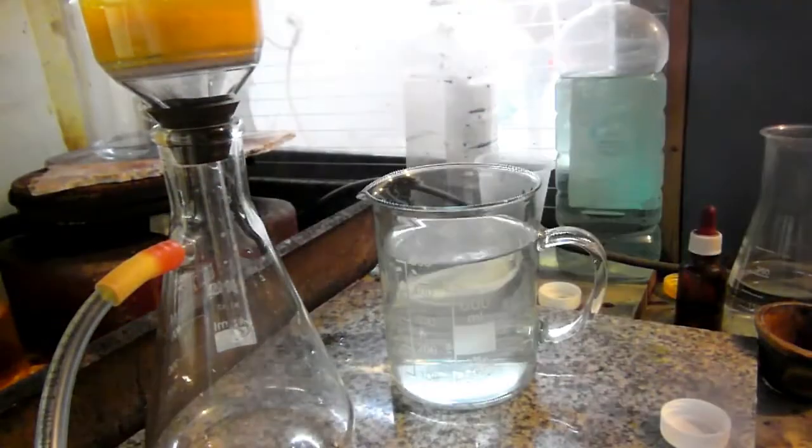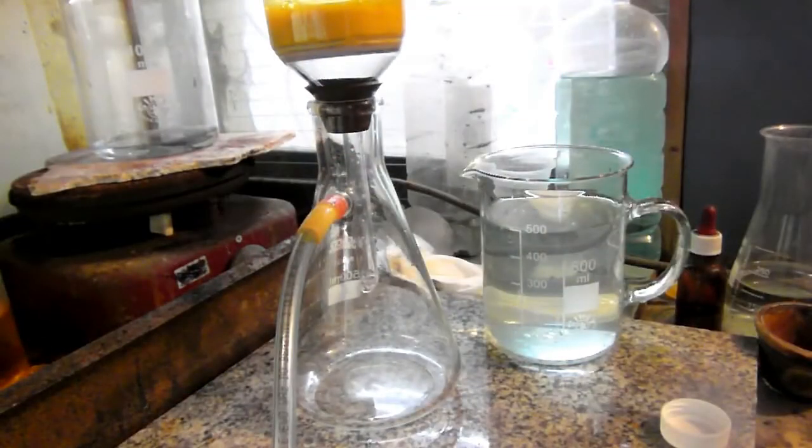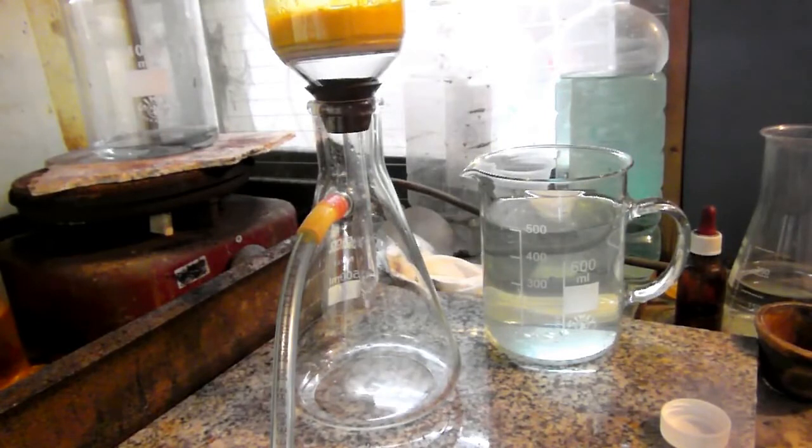The palladium complex is washed with distilled water several times to wash away any silver nitrate left. From this point, the yellow sponge can be dried, calcined and melted, converted to palladium black using formic or ascorbic acids. In my case, I've decided to re-dissolve the sponge in aqua regia, filter and precipitate again.